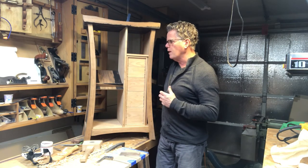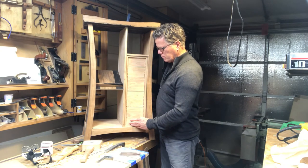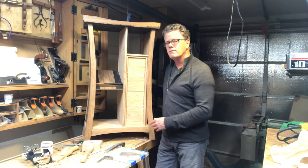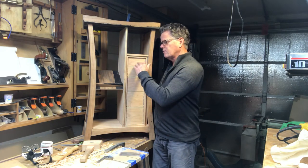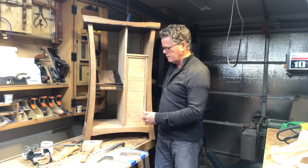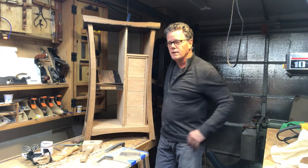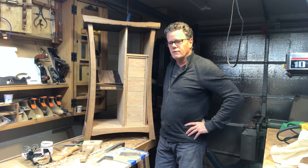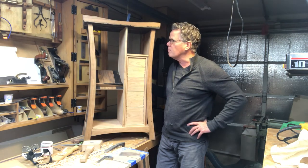My hope was to have a 3/8 solid drawer front with a vertical grain, but given that the drawer boxes are going horizontally, if I have a vertical grain the concern is that there'll be some contortion and disagreement among the wood. We know wood moves, so that could lead to some problems.